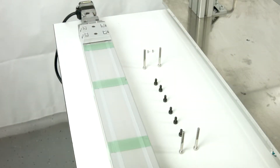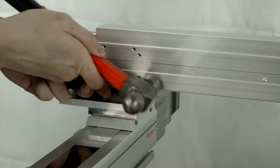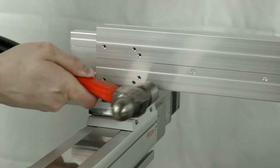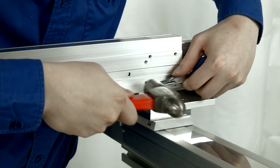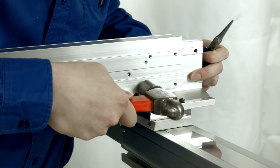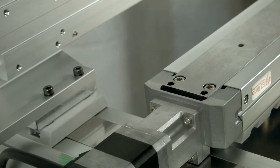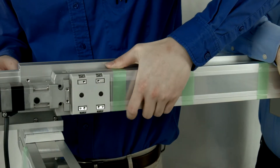Gather the parts to assemble the Y slider. The longer M5x45 bolts are packaged in the box with the slider and will go in through the front; the M5x10 bolts go in through the back. Begin by inserting the pins and lightly tapping with a hammer until they protrude by 3mm — the pins rest on the side of the linear guide in the hole indicated. Attach the Y slider and fasten the M5x10 screws through the back.